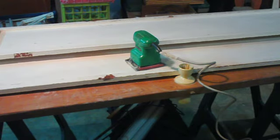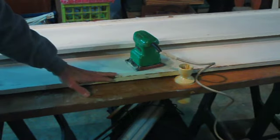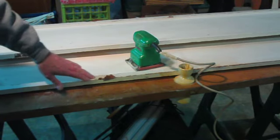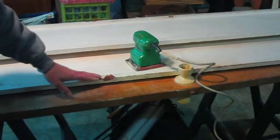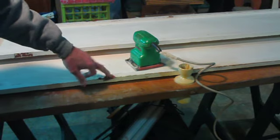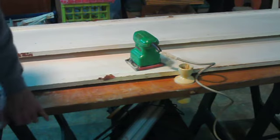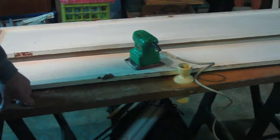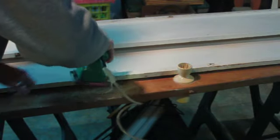after it's painted. Okay, now the first thing we want to do is prep this area, and to prep it we need to feather the paint back so that we get a good bond. The Bondo works better when it's right up against solid wood. You like my custom workbench, an old door, but they work. So we're going to sand this and feather it back.